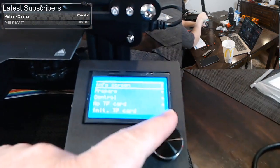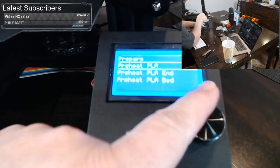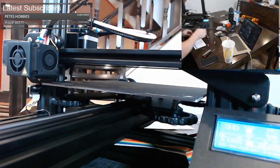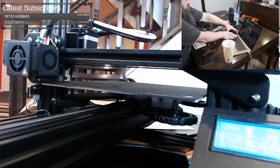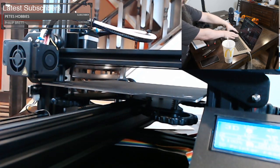So first thing we're going to do is tell it to heat up. So we go to prepare, and we scroll down until we say preheat PLA, and we say preheat PLA. You hear some fans and stuff kick on. At this time, we're going to go ahead and take our card. I'm going to maybe print the stringing test that I did earlier. So this is a test file I built earlier to just make sure things are kind of like calibrated properly. I didn't make the model itself. I just prepared it for the Ender. So let's say, where is it? Stringing G-code. I think I did that one. The only reason I'm doing this file is because I know it's quick, because I don't have all night to do this.